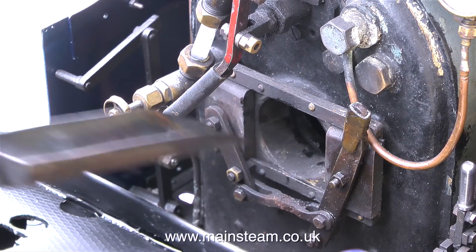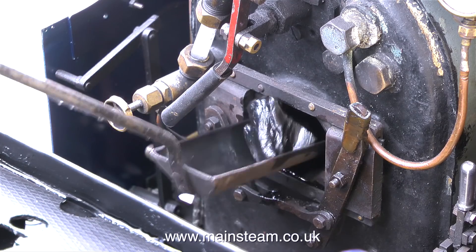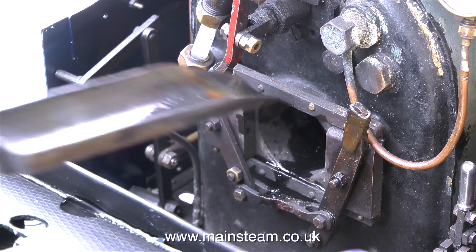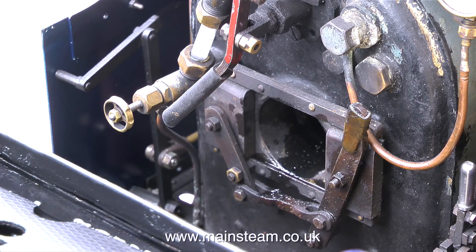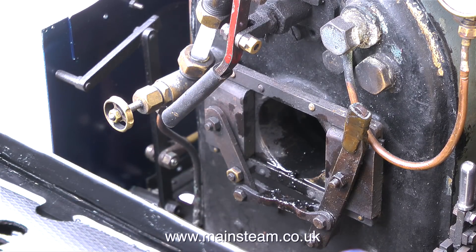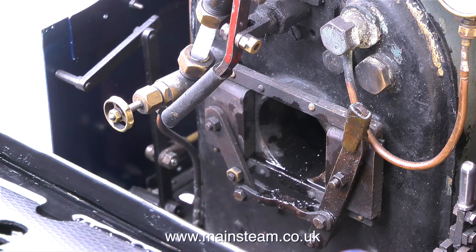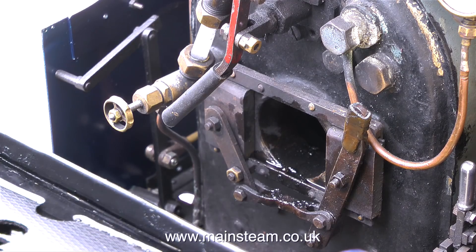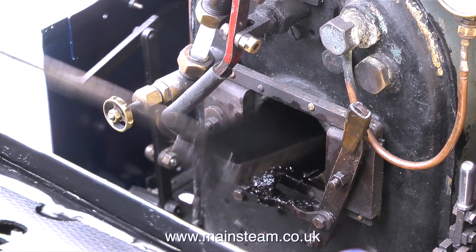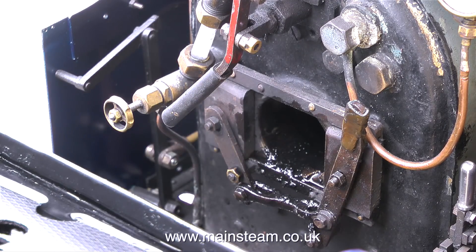The first piece was a bit too big so I'm finding some smaller pieces. Some of these pieces of charcoal are too big for this engine — don't forget at the steam workshop a lot of the engines are much bigger than this one. In the bottom of the tub full of charcoal and paraffin there are some smaller pieces, so I'm having to dig those out. Here's a good tip: as you scoop the paraffin-soaked charcoal out of the tub, always tip the shovel slightly over the container to drain the paraffin back in. Otherwise you could end up with a pool of paraffin just below the engine and around the ash pan, which is not a good idea.